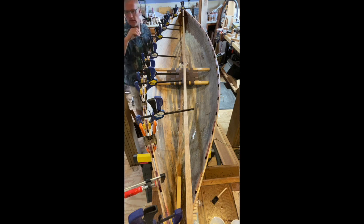All right, there you have it. That's about all the clamps I really have, so I will do this one side at a time. But again, you notice I was able to just kind of go quickly through, coat it, pop it on, and now my gunwales are set. We'll let this go for a few hours, and then I need to clean up over here with some of the epoxy before putting on that gunwale. So again, I gotta do all of the edges and behind, and then we'll be ready to put this on maybe late tonight or early tomorrow morning. But at least you got to see what it looked like, and it does go fairly quick even when you're doing just the one piece at a time. Easily manageable when you do it that way.